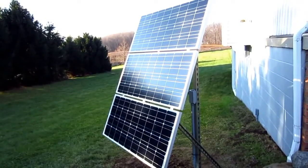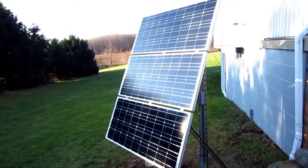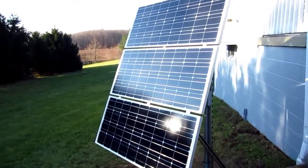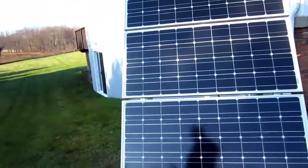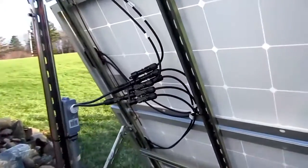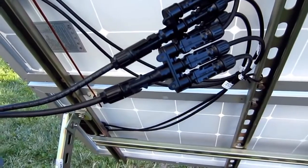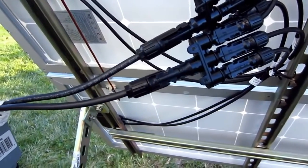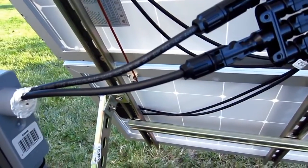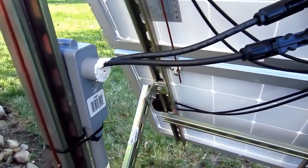This was designed to meet the current NEC guidelines, which changed quite a bit. You can see the three Renogy 100 watt panels — they're wired in parallel and will charge the 12 volt battery system. Stepping behind, you can see I used three-into-one connectors. These are MC4 connectors, and I bought 30 feet of connectorized 8 gauge MC4 cable.